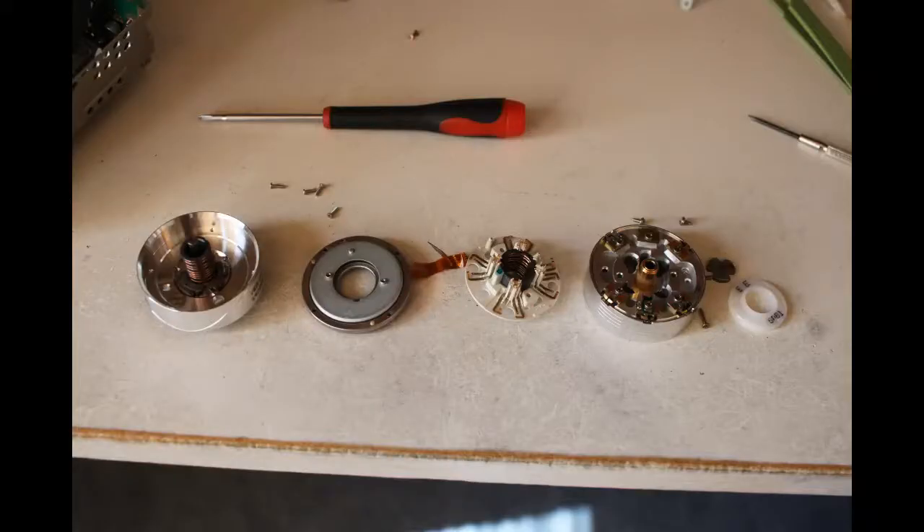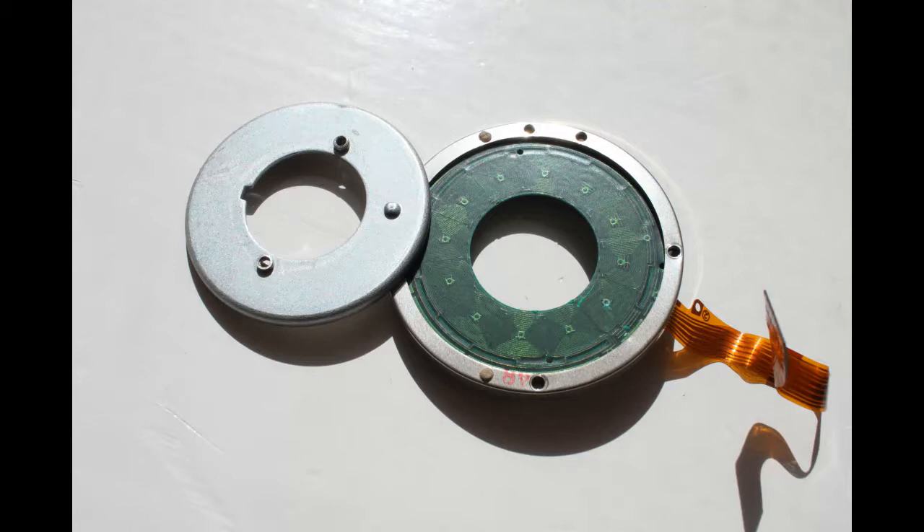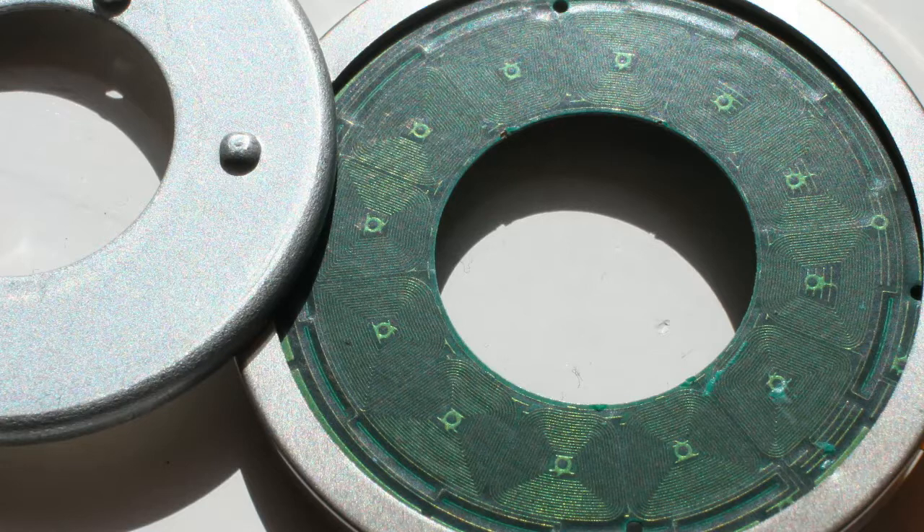The next part is the motor and this appears to be a DC brushless motor. Such motors have an array of coils and a spinning magnet sitting above them. In this case it doesn't have a traditional arrangement of copper wire coils - the coils are actually printed on a piece of PCB, which I've not seen before, so I'm assuming it's probably common in this kind of equipment. In here you can see a close-up of that, and if we zoom in you can see the individual coils on the PCB. The magnet is the piece on the left hand side in this photo and that actually screws onto the remainder of the head and makes the whole thing spin.